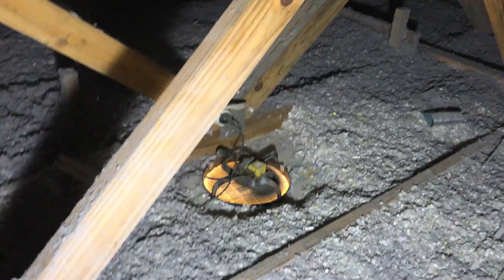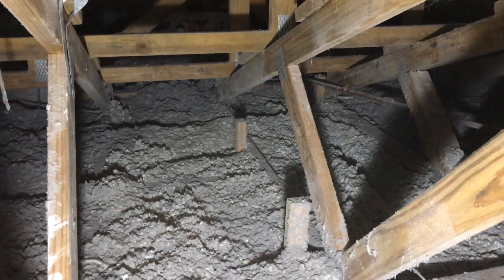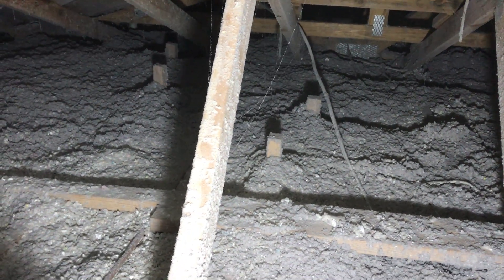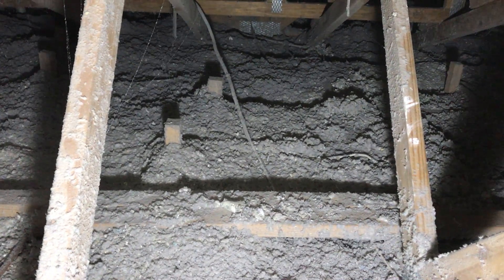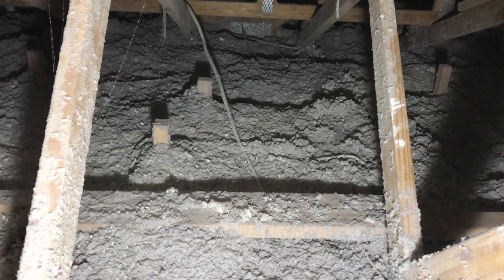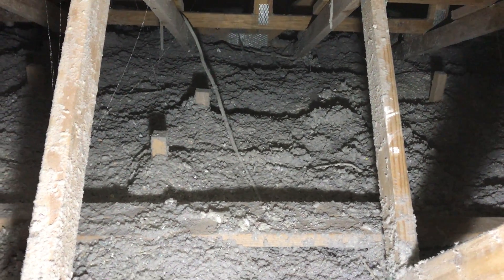This is the same job — I've just finished topping up the edges. You can see there's a little bit of fluff on top of the joists here, and I've pumped it right out over the edges so that's all filled. That's just the way the job's meant to be done properly. Any of the little low bits now look low because I've pumped on top of the joists. Just in front of me near that second stick you can see a little shadow — that looks like a low bit, but the cellulose on either side on top of the joists is actually at the right height, with a bit extra pumped in.